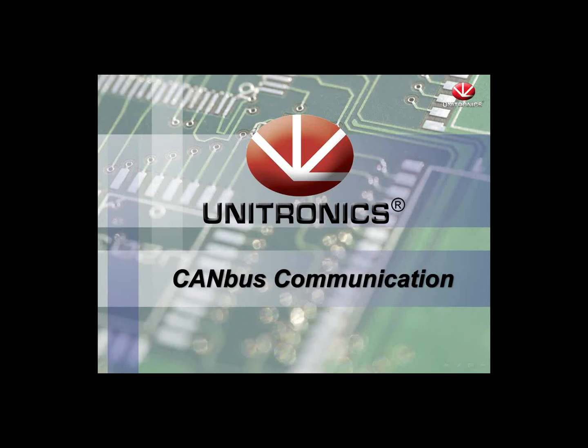UniCAN is a CANBus protocol. We will go over a quick slideshow, and we'll look at an example of two controllers communicating, and then we'll look at an example of our EXRC1 remote expansion adapter communicating to a 570 with an IO DI8 R08 and an IO AI4 AO2 sending remote IO back and forth between the controller.